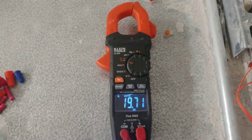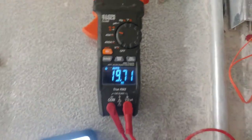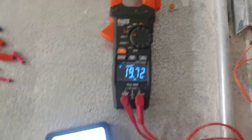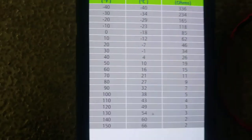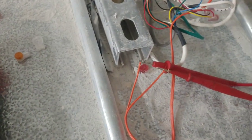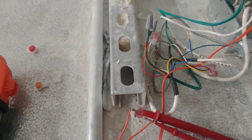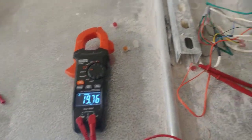If you're ever in doubt about something like that and it doesn't make any sense, that's because it's probably wrong. We're reading 19.72k ohms, which puts us at 50 degrees — pretty much exactly what that line is. Now this thing will read properly and regulate the electronic expansion valve through the store's central computer and hopefully not freeze up anymore. That's going to conclude this video, thanks for watching.